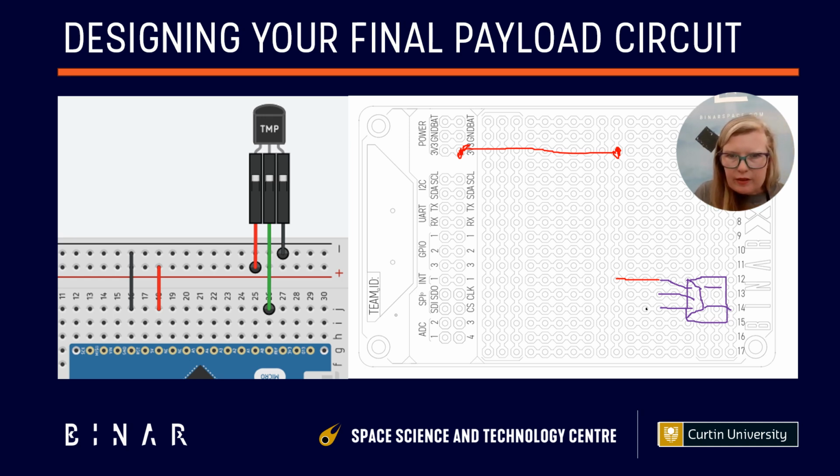So we're going to do our little solder point here and actually come over again to the power rail, the bit that I haven't used yet. And we're going to go here and solder it there. And then that means it travels all the way up here and I can just go like, oh, sorry, that was a horrible drawing. Like this into the ground. Just like that. All right, so that's where that's going to go.